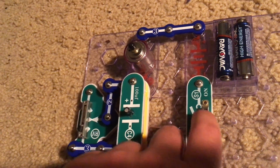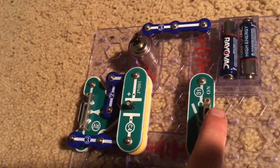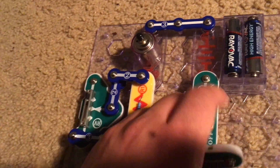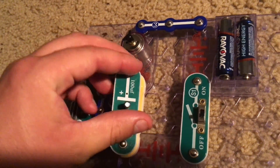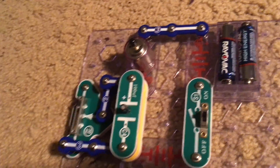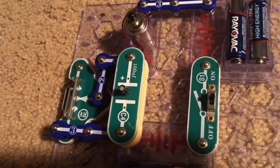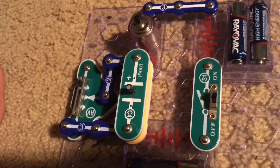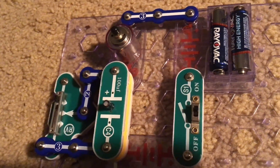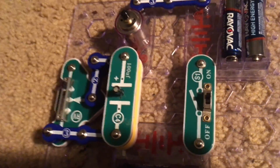The motor starts pretty easily. In the previous circuit when the RV was at its lowest setting, the motor may have required a small push to get it started, but with the C4 capacitor we won't have that problem — it starts on its own. That is because the capacitor allows a short surge of electricity to flow through it until it charges up, which stores the electricity to bypass the higher resistance of the resistors and give the motor a head start.